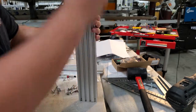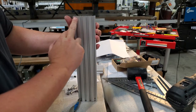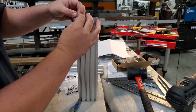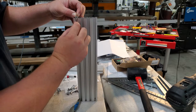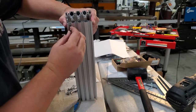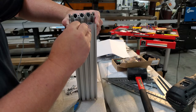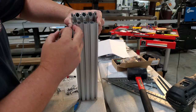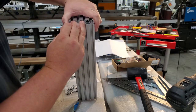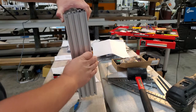Once you're done there, you'll actually be able to make that hole a little bit bigger. The head of your screw is going to sit right there, almost like a little bit of a countersink. Now I widen that hole — you can widen it so that you can get a little bit of play. You want to make that hole a little bigger so it doesn't thread into there, because I'm not machining that hole — it's just a through hole. Then I'm going to be perfectly aligned going right through there, go ahead and screw my corner, and now I have a joint.